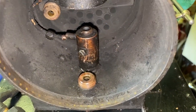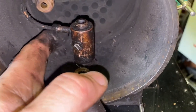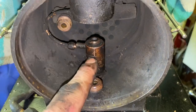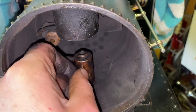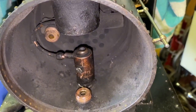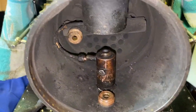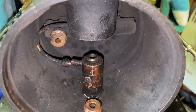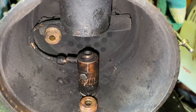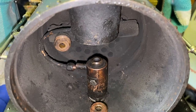Just tightening up the blower pipe while the steam pipe's out of the way. There's a little screw here — if I release that, the center of the blast nozzle will lift out and I can replace it. If I were doing heavy running regularly I could put a slightly larger nozzle in, or for lots of light running a smaller nozzle to give a bit more draft. But generally this is a pretty good engine and doesn't need any changing.